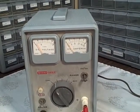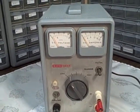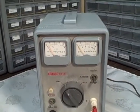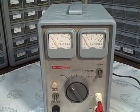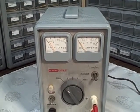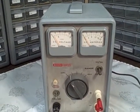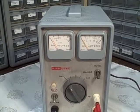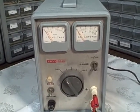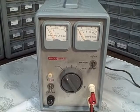Chokes and transformers of this type these days are quite expensive and have been replaced by the switching power supply. The advantage of this particular unit would be a lower noise level than a number of switching units, and certainly at higher currents, about all you'd need to do would be to apply more capacitor filtration and you could virtually knock the noise out. Whereas on a switching power supply, you're very likely to have a high-frequency noise you can't get rid of. So a lot of folks on certain critical circuits would much rather have a linear power supply.